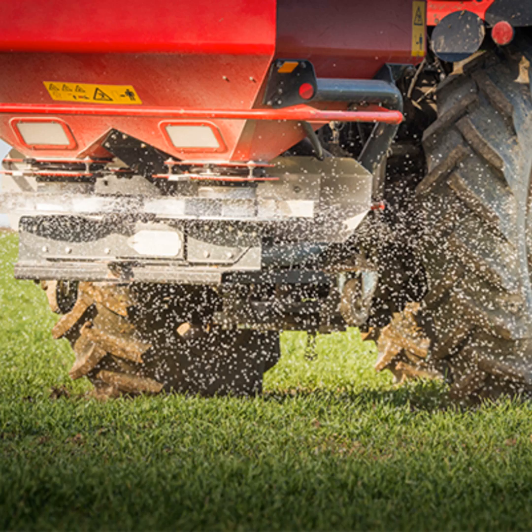One of the things is the driving of the tractor — setting the machine up is fine, but the actual operator needs to do it properly too. It's vitally important that they're driving using the hand throttle. Having the PTO speed set is vitally important to getting your spread pattern right, and your forward speed obviously needs to be right, as well as the spacing and your bout widths.